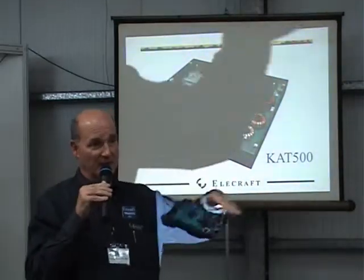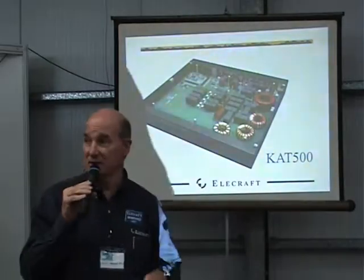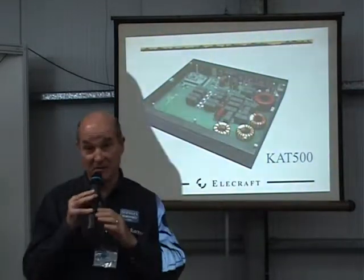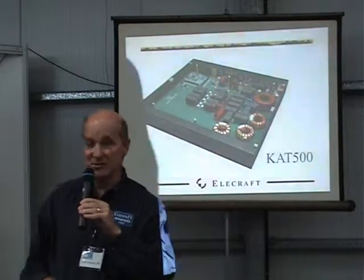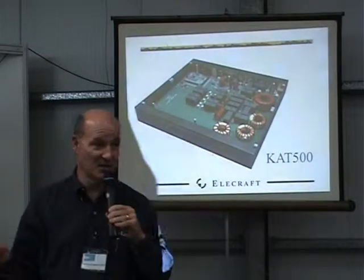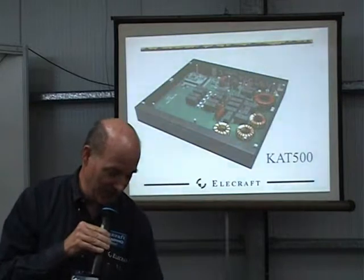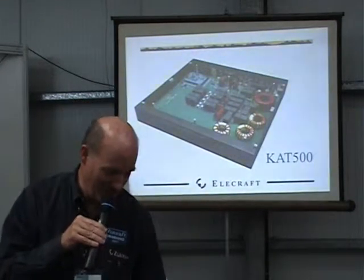So it'll cover your 80 meter dipole on most of the band if you have it resonant at one end and you want to cover the other. The amp will remember every setting across the band, every 20 or 30 kilohertz on the low bands. And as you move across, it clicks immediately back to what you last tuned it to. So having that sit on top of the amp makes a total 500-600 watt station that you don't have to even think about. It just follows you around. And I proved that because I don't like reaching over and tuning knobs like I used to have to do with my manual amps. It's a wonderful thing to do.